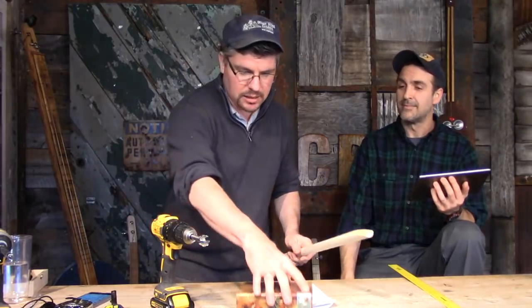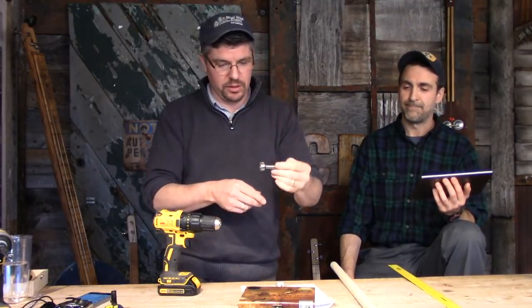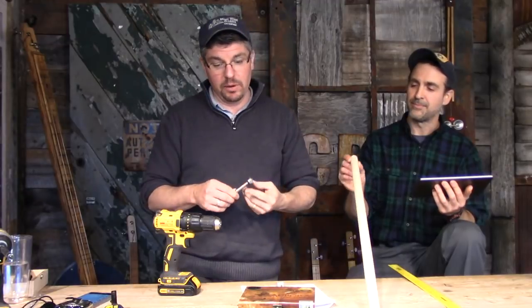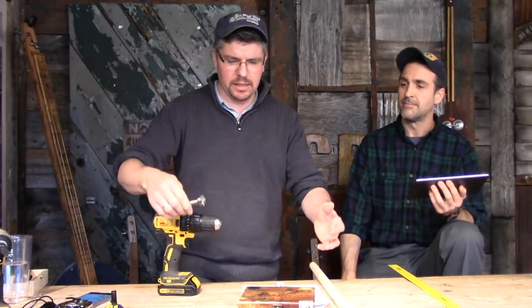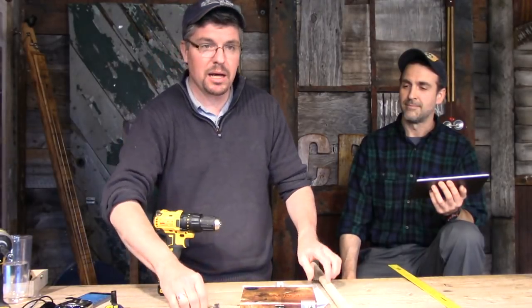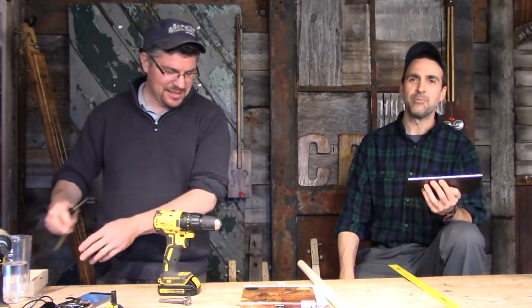So I already tapered the neck. Now I'm going to drill it for the headstock. I'm going to need a 1-inch Forstner bit for drilling the box. You could drill a smaller hole and use a round file or a keyhole saw, or there are different ways. But basically, to get a roughly one inch hole in the box ends for this dowel to go through, the 1-inch dowel was my indicator. So a 1-inch bit for a 1-inch dowel.